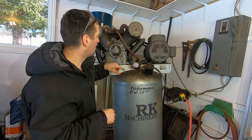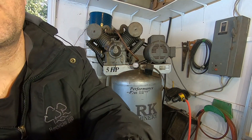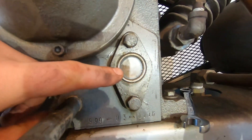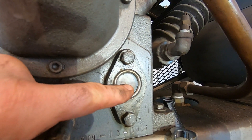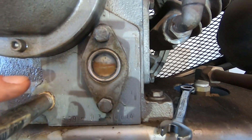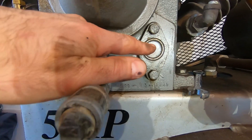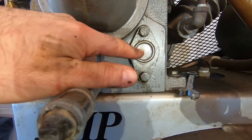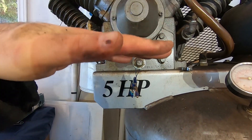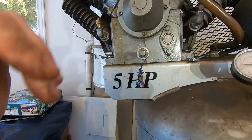Now, how do I know that's happening? I'll show you a close-up of the level indicator — it's actually above the red line. The last time I changed this, I was very precise and set the oil right at the red line. Now it's above that. Not only that, I can see condensation — a milky oil color — behind the glass. The level has risen and the only way that happens is if water condenses in there.